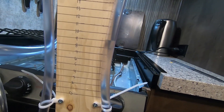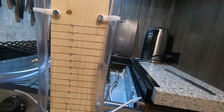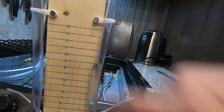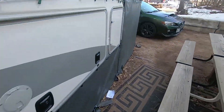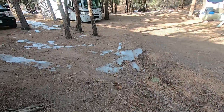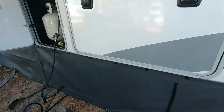According to what I've read online, when you're using about 50% of your total propane, you should be running at 11 inches water column. So we're going to go ahead and bump up the pressure on our regulator so that it matches that intended 11 inch water column. You need to do this while your appliances are running, so I've got the water heater and the furnace going.